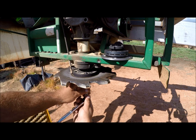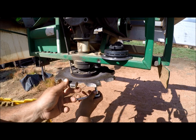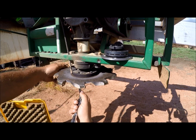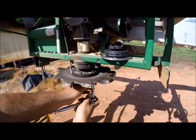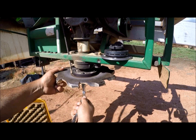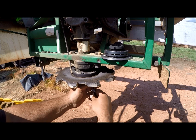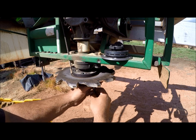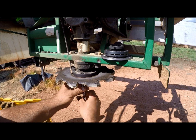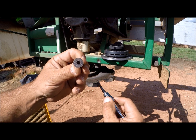A standard Allen driver takes them out, but you'll notice when I start taking these out that they are not very tight — very little pressure is required to loosen these because they have nuts on them, and that's what keeps them tight. If you put them on too tight and they start to strip out on a job site, you're kind of screwed unless you've got a welder. The only easy way to get them out is to weld a bit into the screw from underneath — and you lose a bolt and an Allen driver. So I don't put them in very tight, just hand tight.